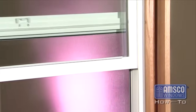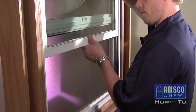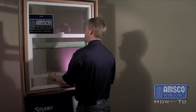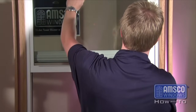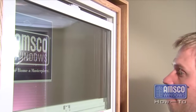If you have a balance spring that has come loose and disengaged from the window, simply start by manually lifting the sash of the window until the opposite balance spring engages the take-out clip. If both balance springs are properly seated in the sash currently, simply lift the sash and engage both balance springs into the take-out clips. Once the take-out clips have engaged the balance springs, raise the sash another 2 to 3 inches. You will feel the weight of the sash as it lifts off the balance springs.